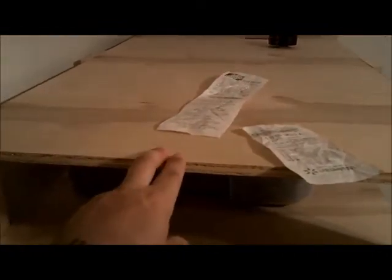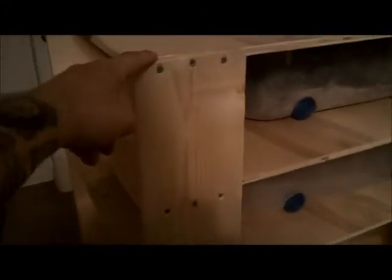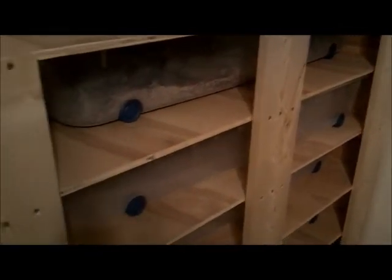And as you can see, that's the plywood. These are the 1x6x8s. I had them pre-cut down. This is actually 2 foot by 4 foot, 2 foot by 4 foot, so on and so forth. So you cut your two sheets into 2x4s, and that will give you all your shelves for all the tubs that you're building with this, and one for the back to create a back piece. And then your 1x6x8s, if you get three of them, creates three legs. All right, so no scraps for this at all. And then of course your screws.